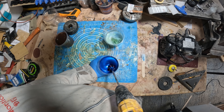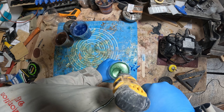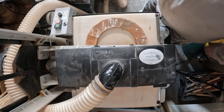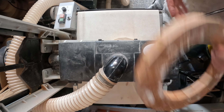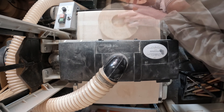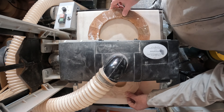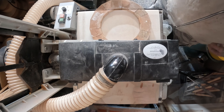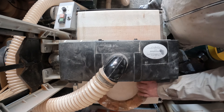It's the next day and the segmented rings are ready for sanding to make them nice and flat. Each one is passed through the drum sander multiple times. The large oak ring only needed to be done on one side. Each one takes about five minutes to do, so I won't show them all being done.